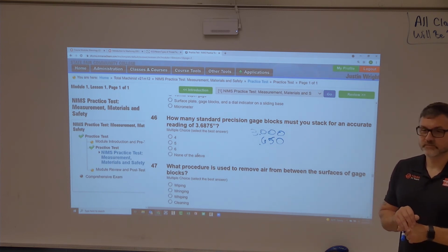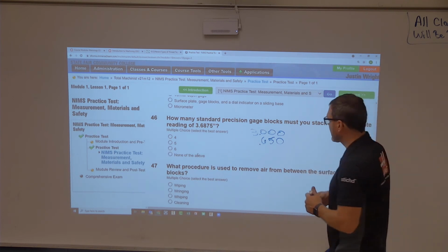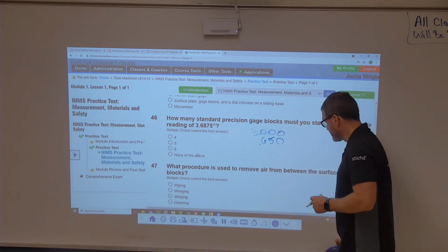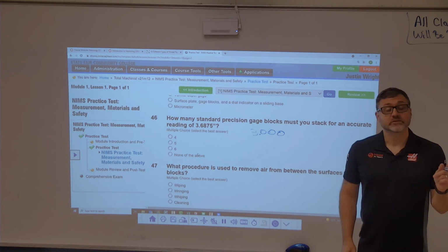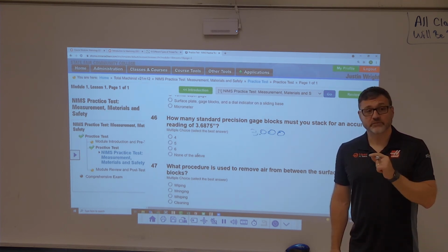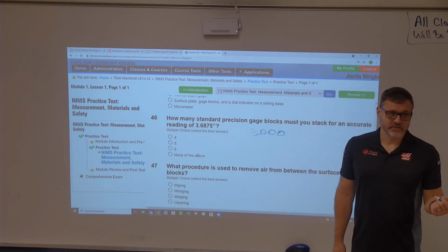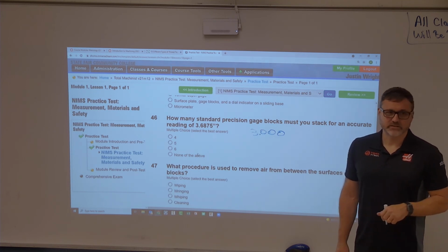Eden, what do you think next? Are you looking or just staring, hoping that somebody else will get the answer? Maybe like 0.145 in it. Instead of this or with this? Instead of that. Okay, do you have any gauge blocks that have a 5/10? So it's probably gonna be a 100 and 5/10. Cause I've never seen one, I don't even have any to work with. I mean, a 5/10 gauge block would be so thin you could see through it. So yeah, 50 thousandths is the smallest gauge block that's in a set, I think.